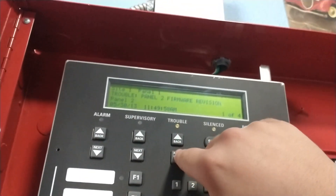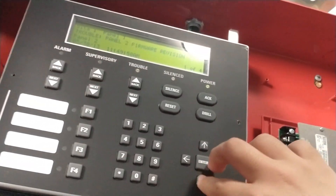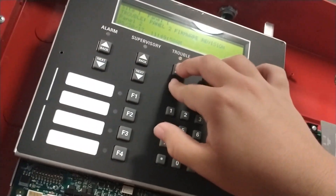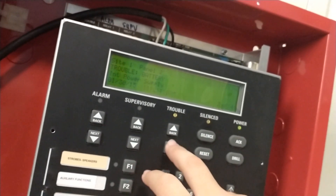Did I finish dialing? No. Let me see the troubles — so it's firmware, firmware, firmware, firmware. I guess I can't look at it right here. Okay, is this the main panel or something? Oh, that's Panel 2. This should be Panel 1 — yeah, this is Panel 1. So I'm gonna make this actually say Site 2. We got battery open circuit. There's only three troubles, I don't know why it's doing that.